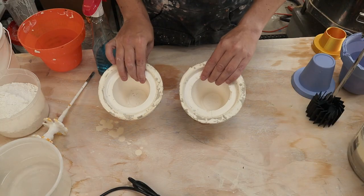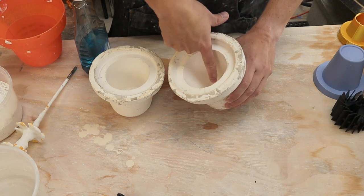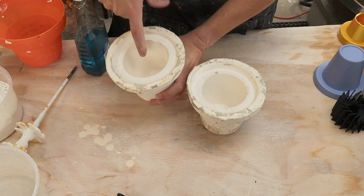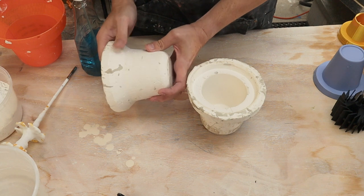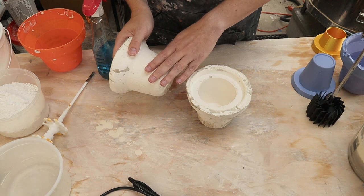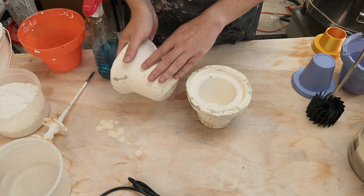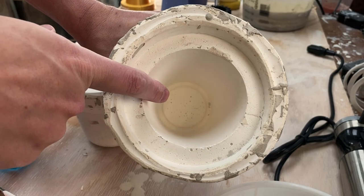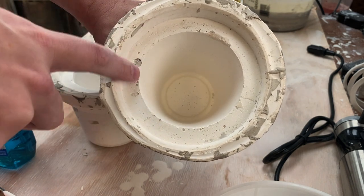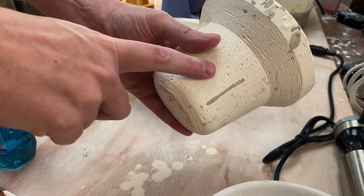So what's the problem? Here are a couple of molds that I've made. If you look closely inside there's a bunch of small pinholes. This one has clay trapped in it since I haven't cleaned out my mold. This one also has some pinholes in the bottom — they're slightly larger and there's a larger defect. On the outside you can really see all the bubbles. This is the outside of the mold so it isn't critical to the pot making process, but it is indicative of the problem. My plaster as I'm making my molds is capturing bubbles and those are transferring through. All these dark specks are bubbles, and there are some larger ones up top as well. These don't transfer into the pot, but these definitely do.